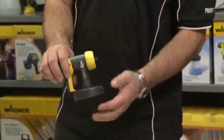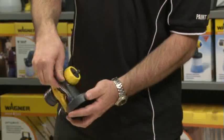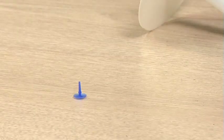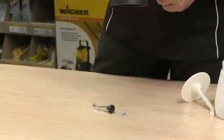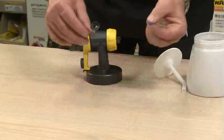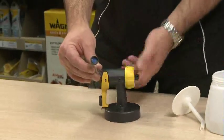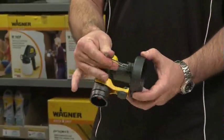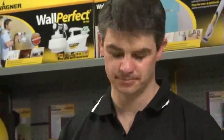On the side of the gun we have the check valve. To pull that apart for cleaning or maintenance, pull the hose off the side and unscrew off the base. Underneath is a little blue check valve. If you're getting paint coming back up into this hose, that means the check valve is either jammed open or it's gone missing — lost the last time you cleaned up. That little valve has to be inside for the gun to work. There's a picture on the side of the gun housing showing which way around the check valve goes. The stem on the check valve always goes up. Put the stem into the housing, making sure it goes into the hole and it's nice and straight, and screw it on. You should be able to blow through that hose but not suck back — if you can't suck back through it you know it's good and sealing. Push the hose back onto the side of the gun.